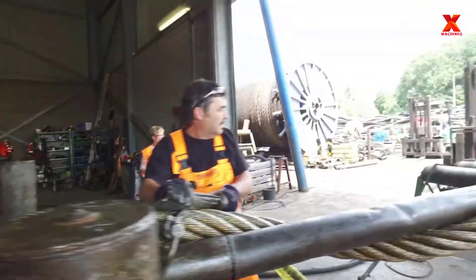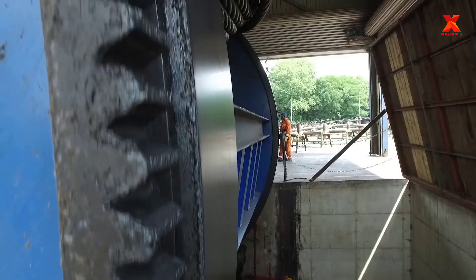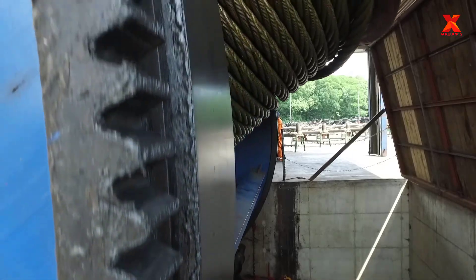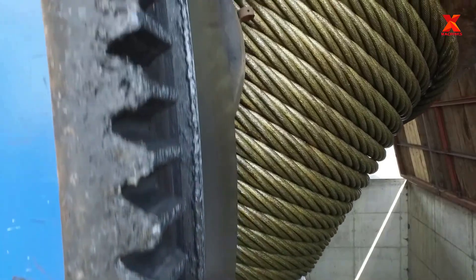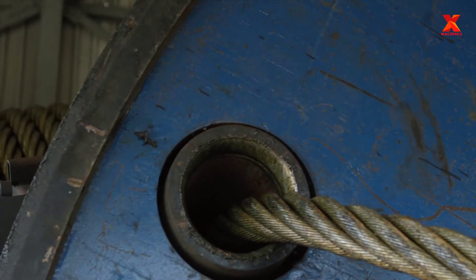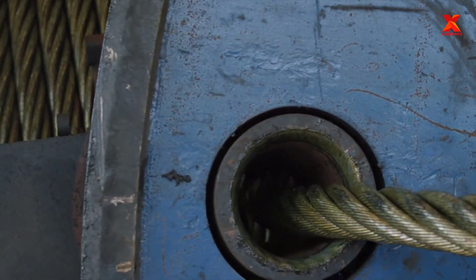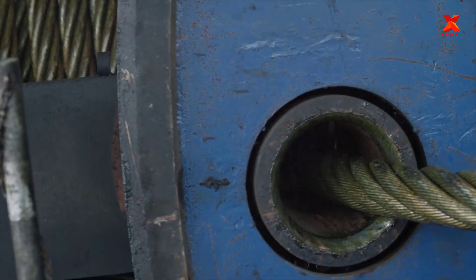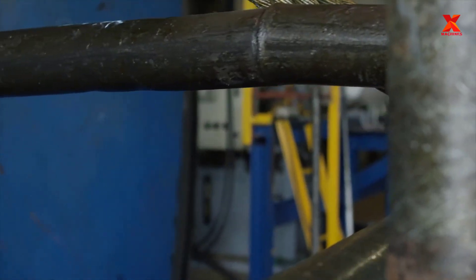What's so special about this cable-laid grommet is the length — they have a circumference length of almost 170 meters. They have piece weights of almost 70 tons, making it something very unique. This wire rope has set two new world records, including the world's largest diameter wire rope at 420mm and the wire rope with the largest calculated rope breaking load at 15,306 MT.